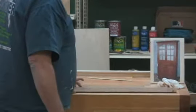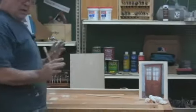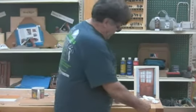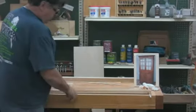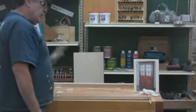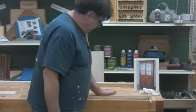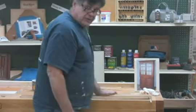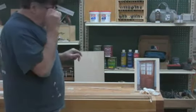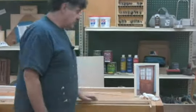So what I did was, I actually put it back in traction. I wet it, and I took a little 3/8" piece of wood, I put it on this end, and one about right here, because this was my flex point. Soaked it good with really hot water, and I clamped it down this way. Remember yesterday we had it in the middle and going down on each end? I reversed that. Now the reason I reversed that was because I wanted this surface exposed.